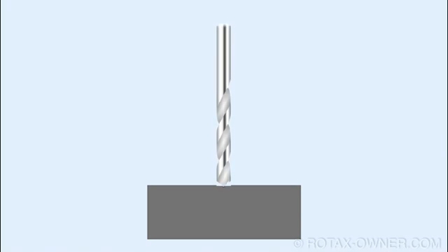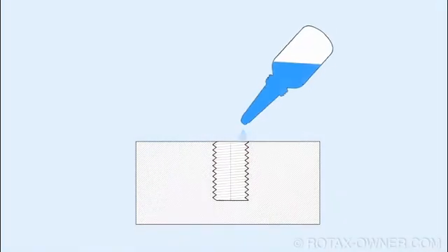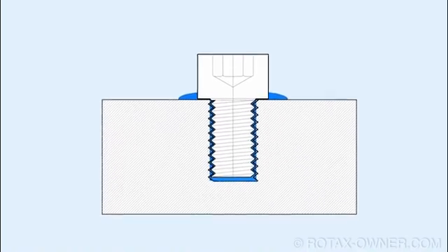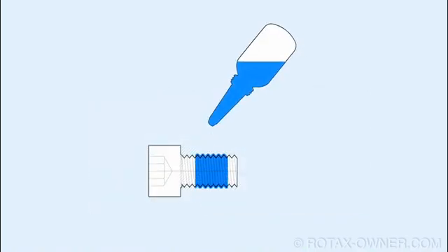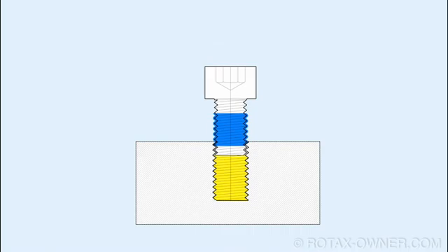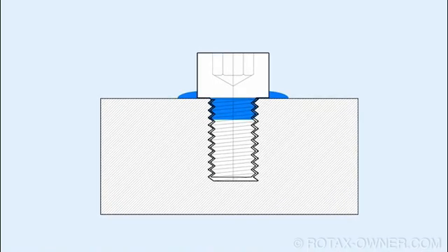When applying Loctite to a blind hole, it's very important to follow Loctite's required procedures to ensure proper coverage and adhesion. A blind hole is where you have a hole drilled to a specific depth but does not break through to the other side of the workpiece. Shaken Loctite threadlocker should be placed down the sides of the threads in the hole itself, to ensure the Loctite coats all the threads and that no air is trapped. If Loctite is placed on the fastener threads only, air is trapped within the blind hole and will escape past the threads as the fastener is tightened, causing the Loctite to be forced out and proper coverage will not be achieved.